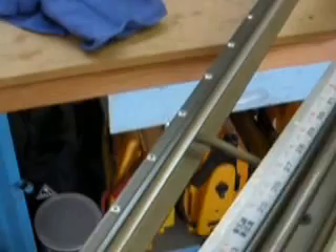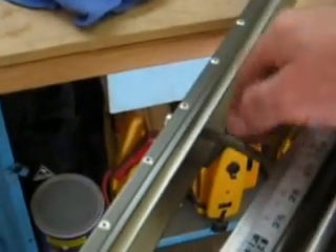We have it set to the appropriate twist. Because of this design, I had to put a stiffening bar right here inside the unit, because before I always used a cutter that only cut in one direction. This cutter goes in both, so there was a tiny bit of flex in the sine bar, so I had to stiffen that up a little bit.